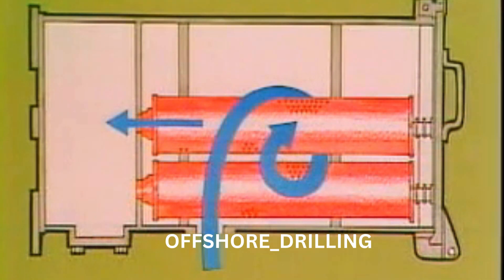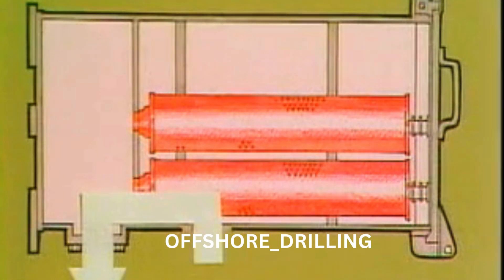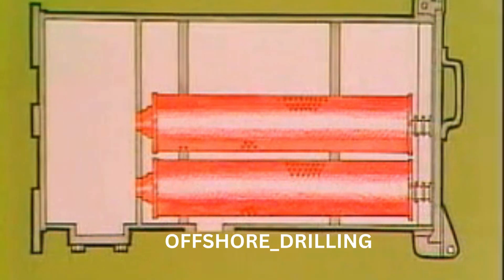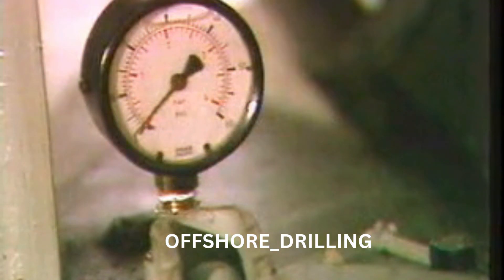The elements seal at the bottom so the oil has no other way to get through other than through the filter medium. If you've got real cold oil or dirty filters, the filter will be bypassed if the pressure is more than 40 PSI. Anytime you see a pressure of more than 25 PSI at rated engine RPM, you should change the elements. These elements cannot be cleaned — they must be changed. You can apply a 0 to 50 PSI pressure gauge to the gauge connection on the filter tank cover to determine the tank oil pressure.